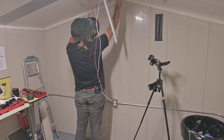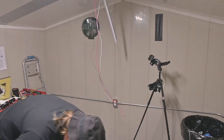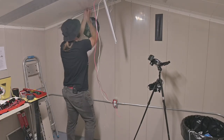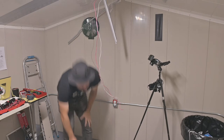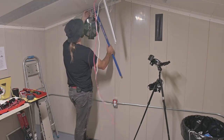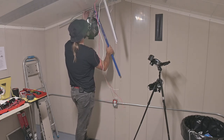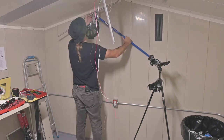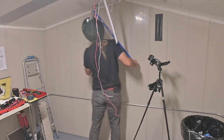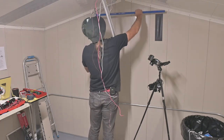What am I doing wrong? Seriously. It goes down this way, all right? And if it goes down this way, you do a 5-inch bend, right? Starting from there, you bend it down, right? You'd think it even lines up like you should, but no. For some reason, when you start bending it down from this position, it doesn't. And this conduit's collapsed now, because it's overworked.